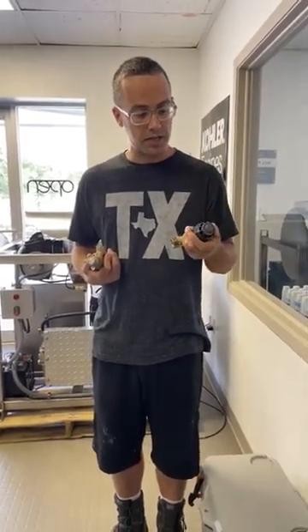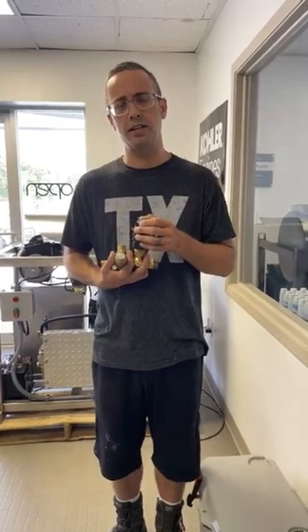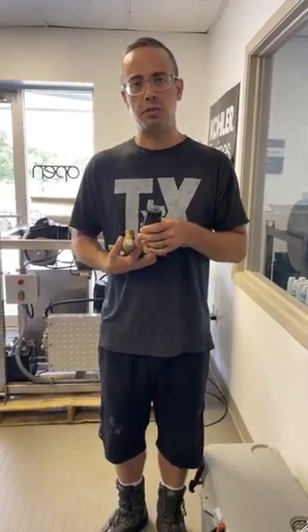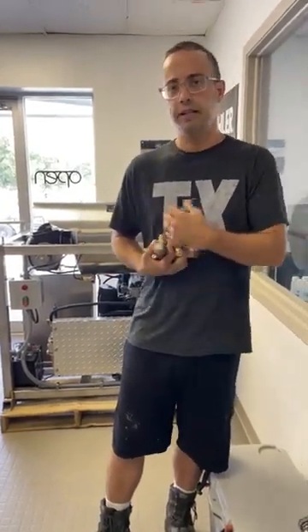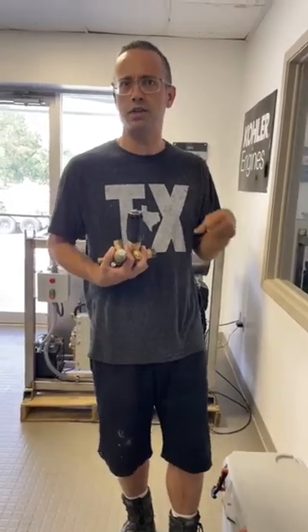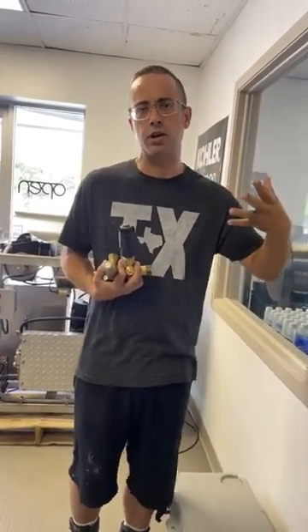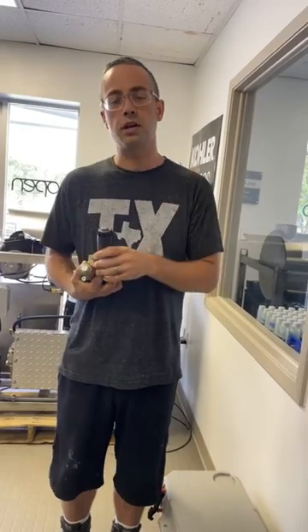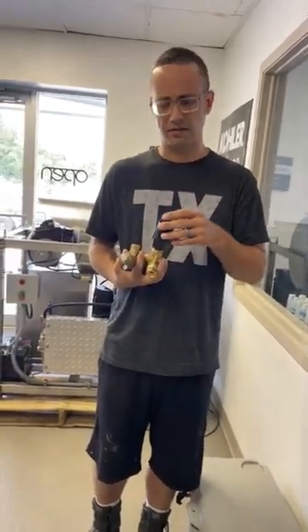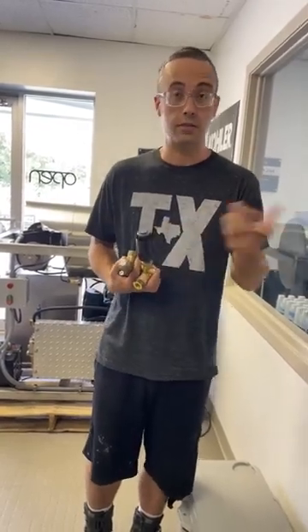That's pretty much the difference between these two types. If you want to Siamese machines, use the VRT3s. If you have employees, I recommend taking the adjustment caps off. In the past, my cleaning technicians would mess with the valve on a smoke break, and then the machine wouldn't start, or it would die when I released the trigger gun — because it's trying to produce 5,000 psi. You'll also blow your belts doing that. If you're an owner-operator, fine, but if you have employees, remove those caps.